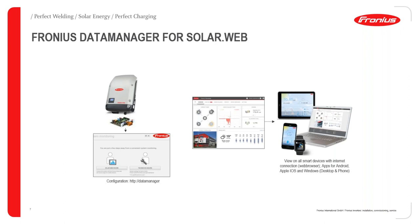The data manager will collect all performance data from the system — that includes production, consumption, and more. When you have a meter, you can view consumption data as well. The data from the sensor box will pass through the data manager, because the sensor box cannot send data directly to SolarWeb — it is not a web server itself. The data manager then sends data through either a Wi-Fi or LAN network over the internet into SolarWeb for monitoring, and this data will also include state codes.